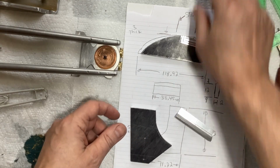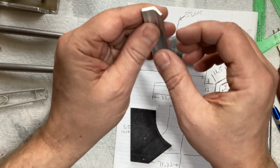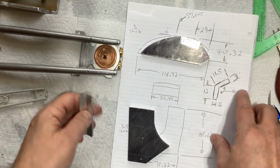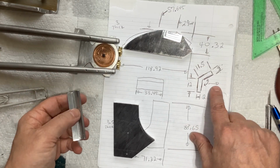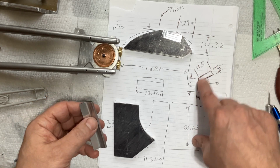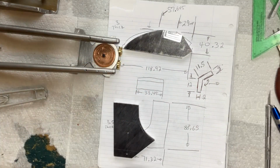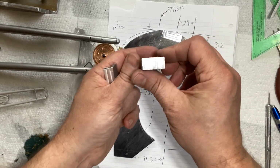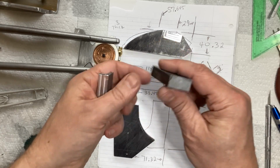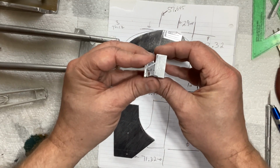Now the angle piece, like I said, I was going to do that as a separate piece. Well, that was this, or that is this. And so again, I just took some measurements to get the angle there. Well, I didn't write it down, but it's 120 inside, 60 outside, and that was just found using this. I have a few of these cut off pieces of aluminum, and the length is pretty much right what I want.